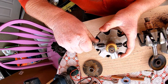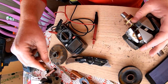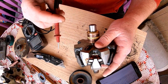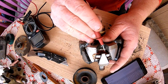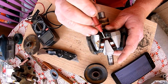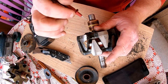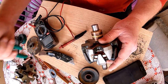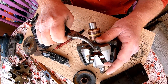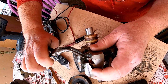No continuity, no continuity. If I can get continuity at those two ends, then I know for a fact it just needs to be re-soldered. I wanted you to see this for yourself - this little wire where it was connected back here broke. What I'm gonna try and do is bring that wire up into here and connect it and see if we can get that working again. What a crazy thing to happen.